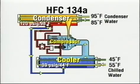Cooling tower water at 85 degrees Fahrenheit flows through the tubes, removing heat from the refrigerant vapor, causing it to condense on the outside of the tubes. The saturated condensing temperature of the refrigerant vapor is 98 degrees Fahrenheit, corresponding to the pressure of 120 psig.